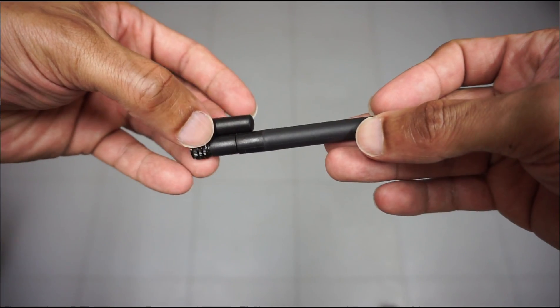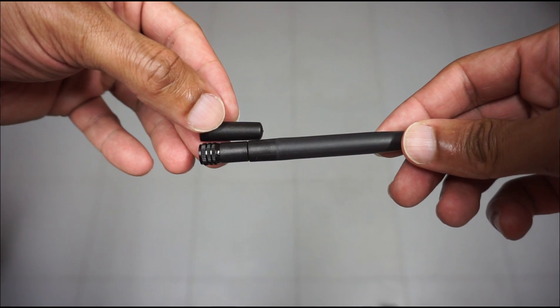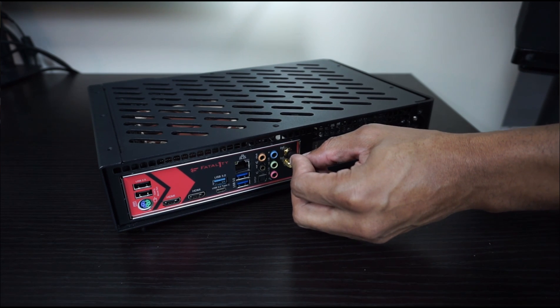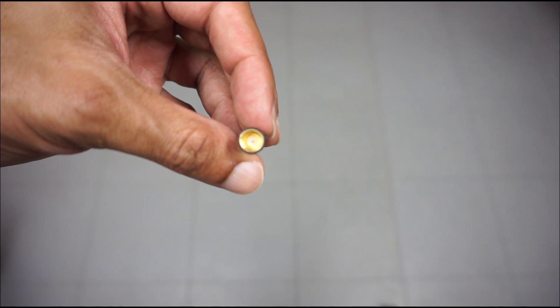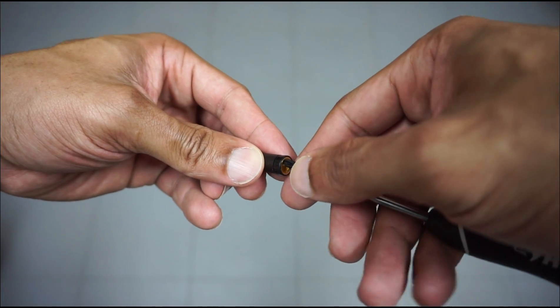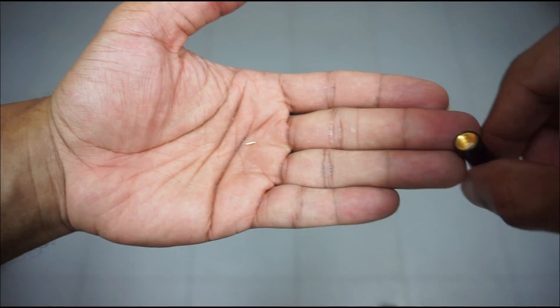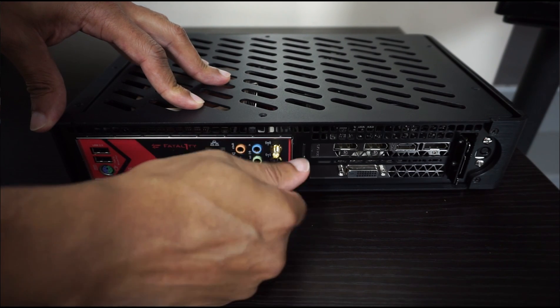It really is almost like three, four, five times as large, so you really are shrinking down the antenna size dramatically. Out of the packaging, I tried to just plug these right into my antenna slots and it didn't fit. There was a little piece of metal that sticks out like you would see on a normal antenna, but the one that comes on this is a little thicker than it should be. I think these were probably designed for a walkie talkie or something like that. So what you really have to do is just take a screwdriver or anything and rock it back and forth a little bit and it'll snap right off cleanly, and then you can just screw it right on.